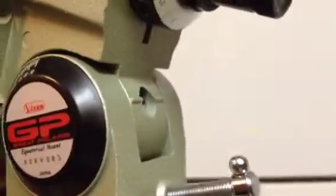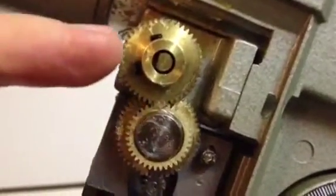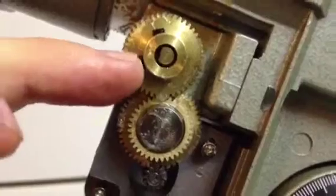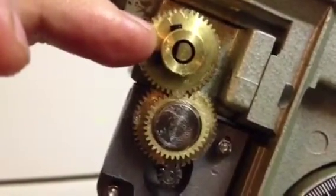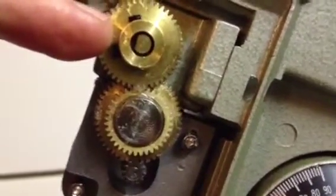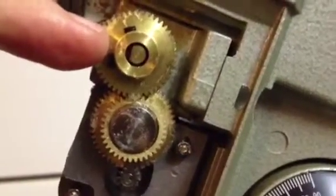Okay, I've secured this bolt fully and put this in a position where it can easily engage. I believe it will be best to rotate this gear until your lock nut is flush with the bevel on the edge of that axle. That'll give you better purchase. So I'm going to make that adjustment now.